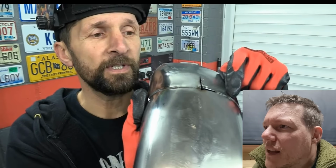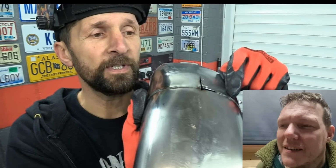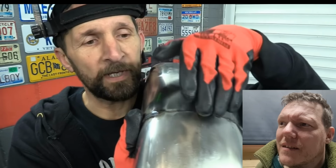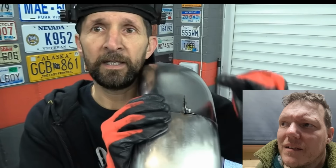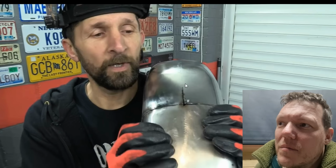All you've got to do is, as this loops upwards at the back, this isn't in line. This isn't level. Look at this lead. Look, it's a ledge. You can't just hammer that down in, because you'll end up with a step in it, and it will look ugly, and when you try and grind that off, you'll go through, because it's only sheet metal. So all you do is cut a little slit in it, like that, and that slit then comes together, allowing that to rest down. But then it lifts up here.